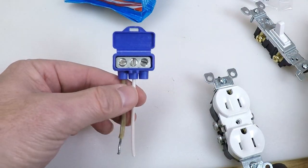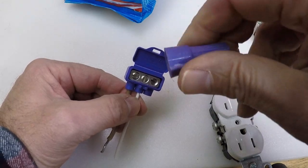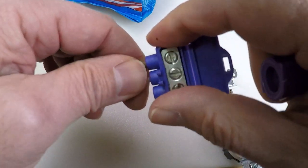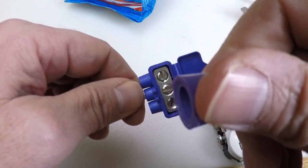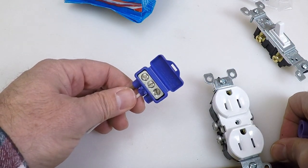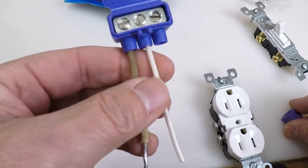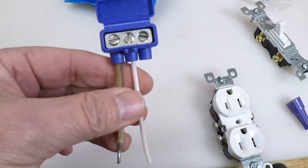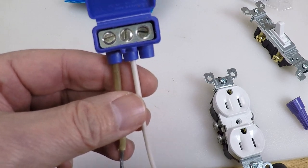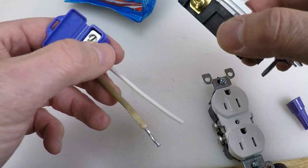The reason I like this better is because aluminum wiring is pretty brittle. When you're twisting together with your pliers before putting the nut on, I've had the little ends snap off of aluminum — it happens because they get brittle and soft. I like these better. This is going to cost you at least $3.50 each, so figure about $6 to $7 per outlet for peace of mind. Then you just need to cut yourself some short jumpers to go to either the outlet or the light switch. I'm linking to these things down below.